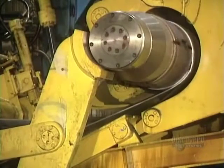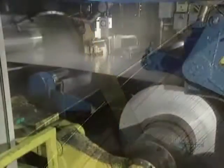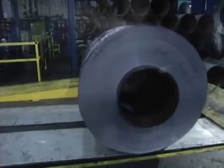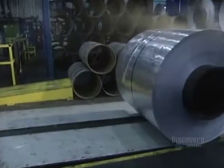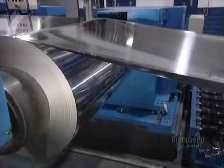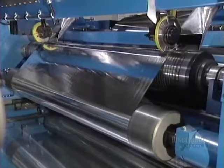The ingot has now become a 5 millimeter thick sheet. It is sufficiently thin to proceed to spooling, where it spools onto itself before being sent to the cold rolling mill, where its thickness will be reduced still further. The aluminum sheet has become very thin and risks being broken by the tension needed for cold rolling, so the sheet is doubled to avoid breakage. One final reduction in the mill, and the sheet will have the thickness required by the customer. A liquid coolant is used to prevent the foil from sticking to the rollers.